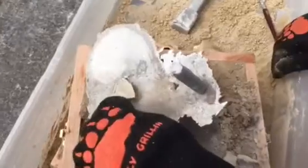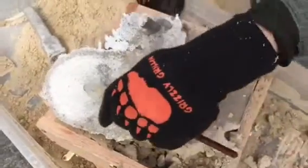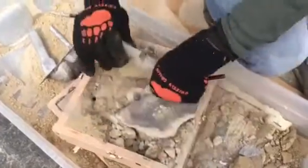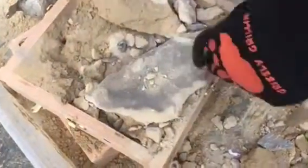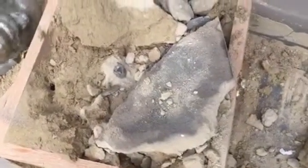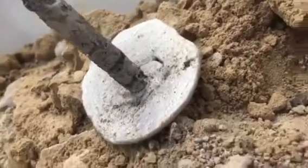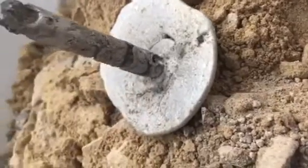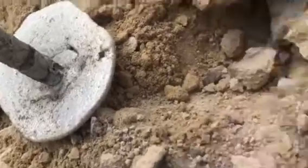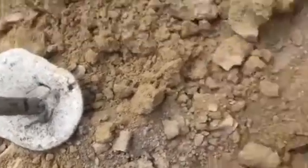What happened was there was gas, and the gas bubbled up and made a big amount of pressure between the casting and the riser. You can see there's a bubble there. I think the casting sand was a little bit too wet, but overall it came out okay so I don't have any complaints. I just finished digging out the risering system and you can see some large cavities on the side — that definitely means it was gases. Since this was pretty good aluminum, I'm assuming it was just the water in the casting sand, because you have to have the sand pretty wet to get a good bond, especially with a difficult mold like that. I don't think there's really anything I could have done about that, and it's not going to be noticeable.